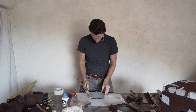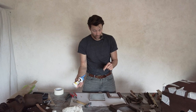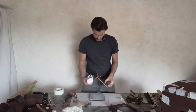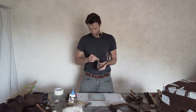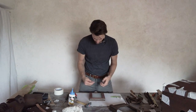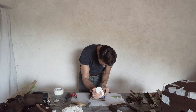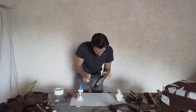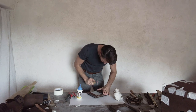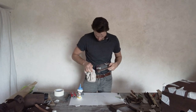I'll just place it on top roughly, and could put the dowels in now or afterwards — I'll do it afterwards. Then this goes on top, so glue comes here. Place it down, take some dowels, put a bit of glue in the large holes, not the small ones. We'll tape it up as well — good, that's set aside.